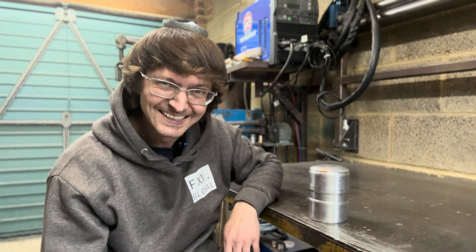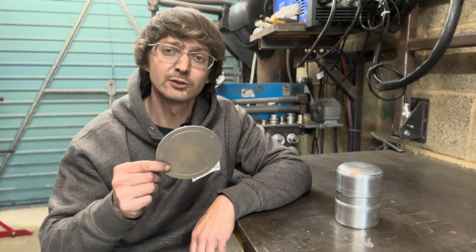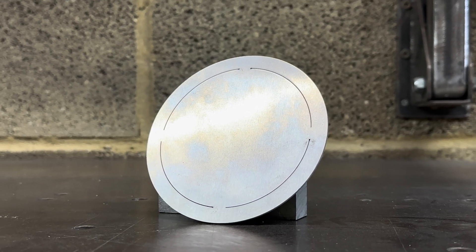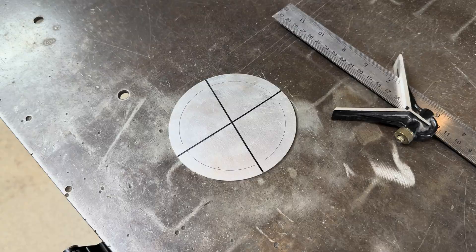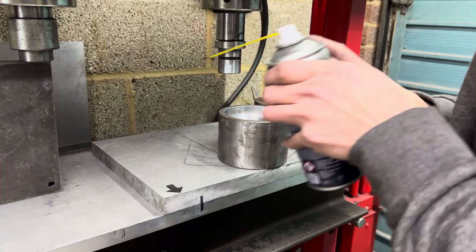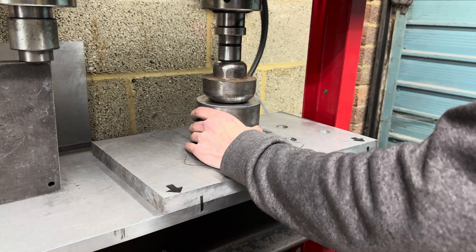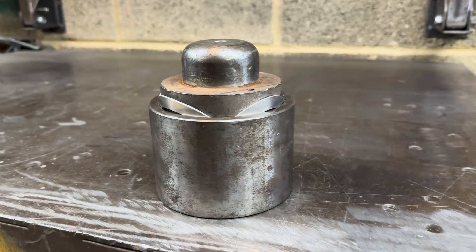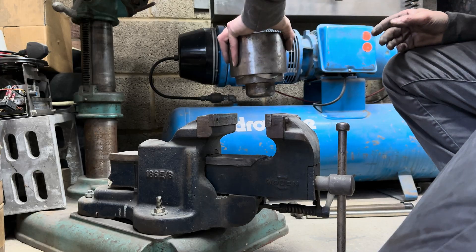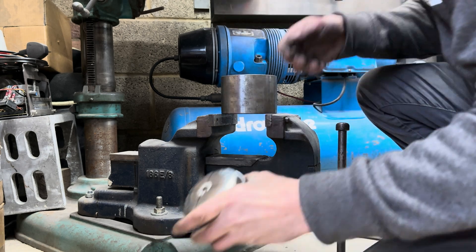He is king! Now that I've finished proclaiming myself as the king of the garage, we're going to do it the smart way. Working smart is always better than working hard. Here, our blank is laser-cut and incorporates four internal slits. These cuts create the final press part and allow us to create an exact smaller cap inside of the larger tooling. You can see where the outer material splits away from the cap, avoiding any unwanted pressure on our part.